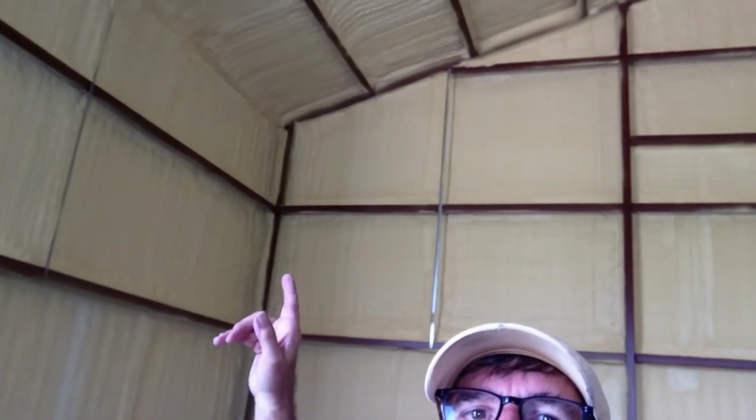So what we plan on doing back over here behind me is we're going to do a bathroom and then a utility room, which is about 8 foot wide by 15. And then we're going to do a shop, workshop, which will be 15 feet by around 20 some feet, 25 feet. And then above that, we're going to put 2x12 joists all the way across. We're going to deck it out. And as you can see up high here, we got plenty of room. We'll have at least 8 foot ceilings above here, so on top of that.